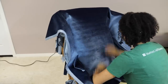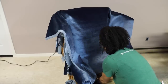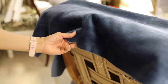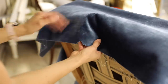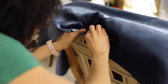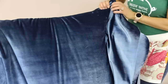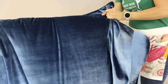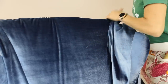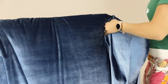The next step was to cut a piece of velvet for the back seat cushion. I test-fit it to make sure it was large enough and straight and even. Then I started from the back at the top in the middle. I notched the center of my fabric and lined that up with the center of the back of the chair. This is important — one thing I learned in upholstery class is to put a temporary staple to center your fabric so it doesn't shift. I added a staple there and then at the bottom, pulled it tight and added another staple in the center. Once the center is secured, I can pull the fabric tight and work from one side, figuring out where I need to make my cuts.